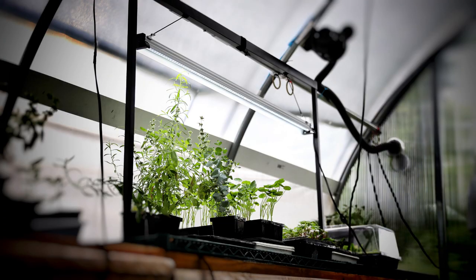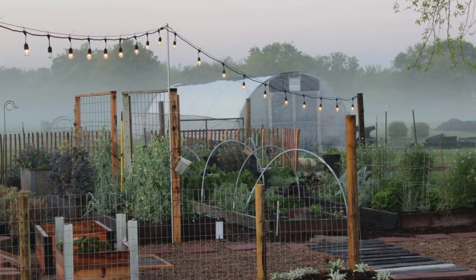There are also utilities to deal with. You have to think about where water is going to come from for your hoop house, and whether you need electrical for lighting, heating, tools, or even just to charge your phone. You need to plan out how far you're going to need to run those utilities and where you're going to tap into them. If you're a couple hundred feet away from your nearest water source, it's not just the cost of PVC — it's the cost of having a trench dug or the labor of digging it yourself.